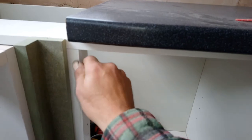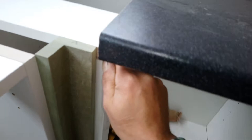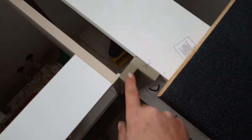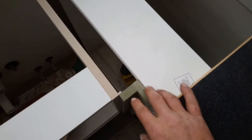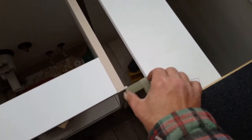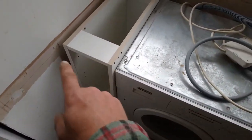500mm doors are about 495 to 497, so that might want to come forward a little bit. I made this the same size as the corner post that was existing, which is like 55 by 60 — slightly different sizes.